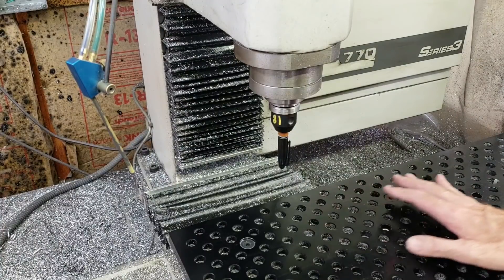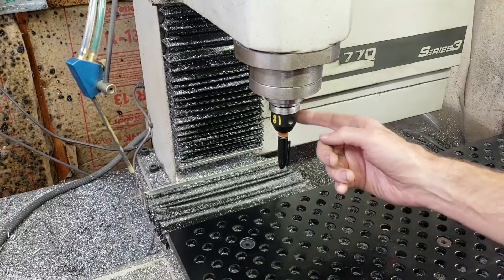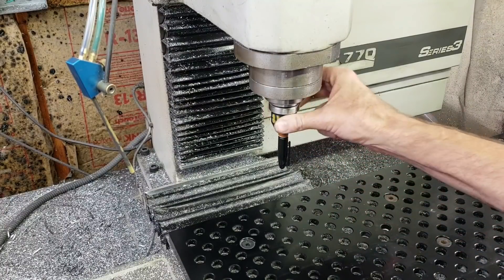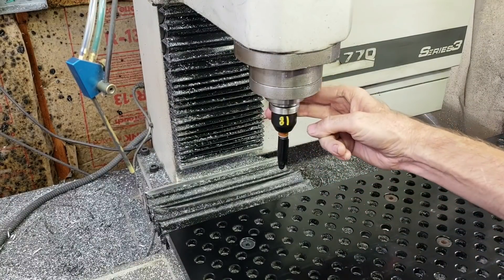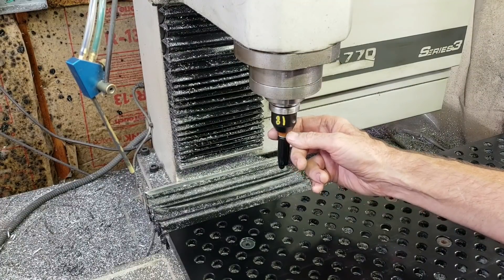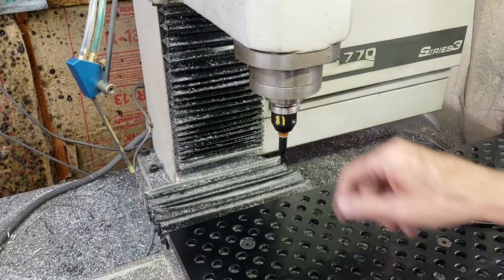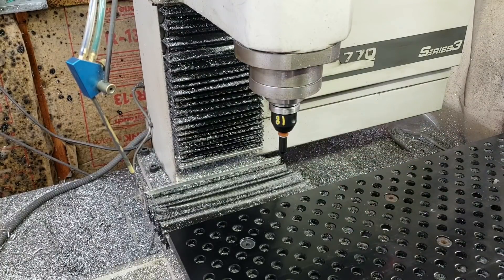If I move the tooling plate on the mill, I have to make sure I line it up perfectly. It's not often I have to do it, so I basically just take a half-inch end mill holder, put some electrical tape on a marker, and shove it up in there with the set screw. It's not totally accurate, but it's good enough for what I'm doing.